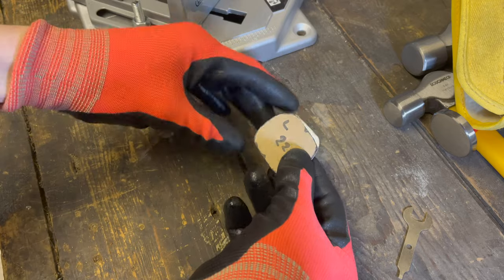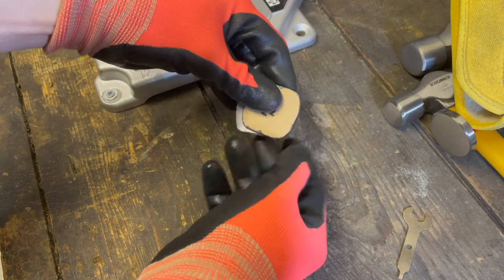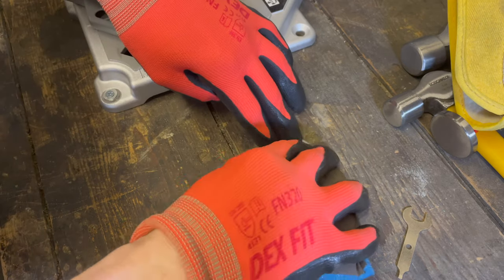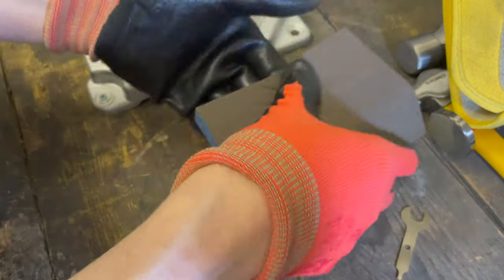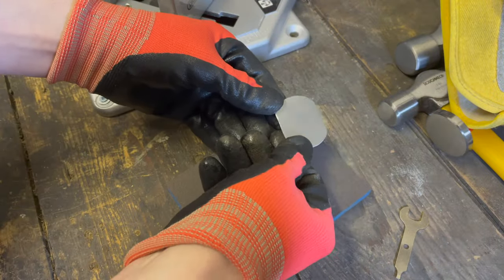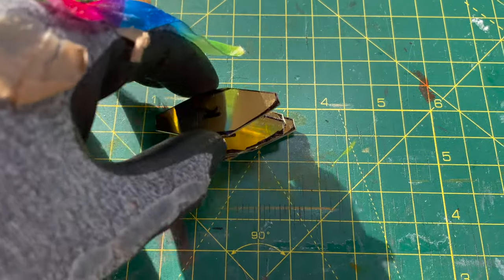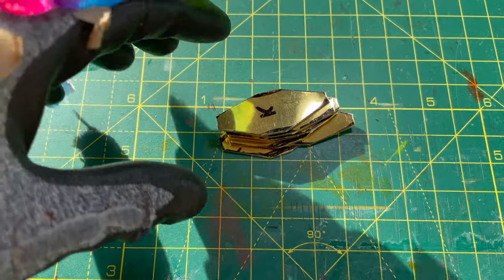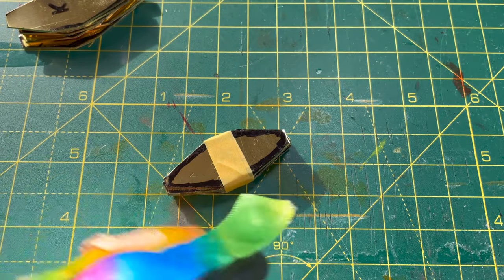Next, we've got a piece of metal that is now exactly the same shape and size as our cardboard pattern. Excellent, but we probably don't need all of these little letters on it, and there are all kinds of scratches accumulated through the processes. We'll scrape away with some lovely sandpaper — about 200 grit — and take this down to make sure it's nice and smooth, keeping the numbers on the back of course. Now the brass parts — a pile of little brass diamonds ready to go. We want to do these in a neat way, so let's tape them all up to do them all in one go so they're all the same size.